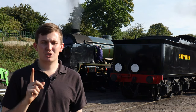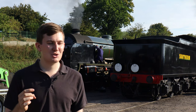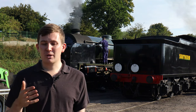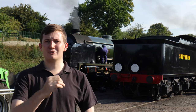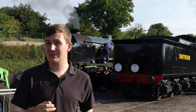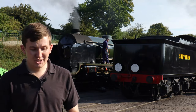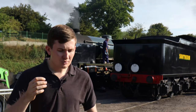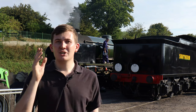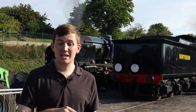Interestingly, the marketing department had already foreseen this potential eventuality. What they did was take a lot of pictures of the locomotive before the run, just in case Mallard didn't actually make it back to King's Cross. The replacement locomotive was reportedly only just in sight at King's Cross when the head of publicity handed out the photos. Crafty devils. Checks like this actually still occur on the national network now without you even realising it. Along the main line there are devices called hot axle box detectors which, as your train goes over the top, measure the temperature on each axle. If one is significantly higher than the rest, it sends an alarm to the signalman who will take appropriate action. You can even get more modern units that have them built in, which is even better.